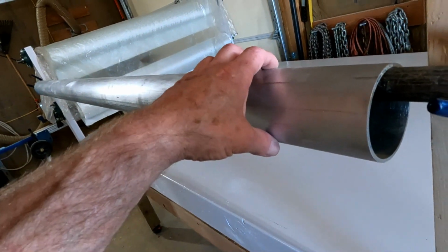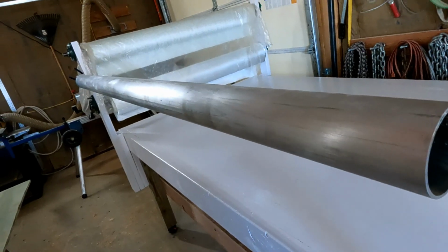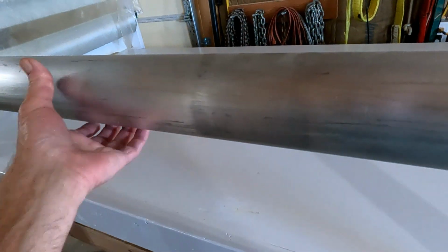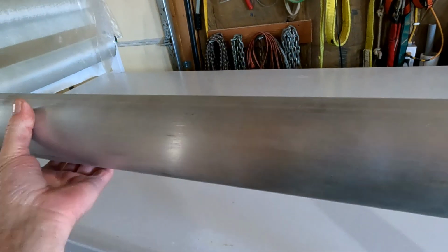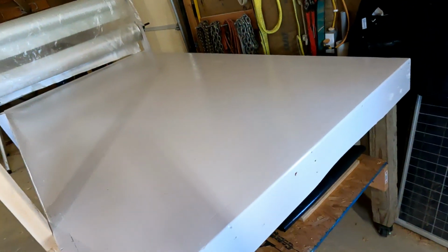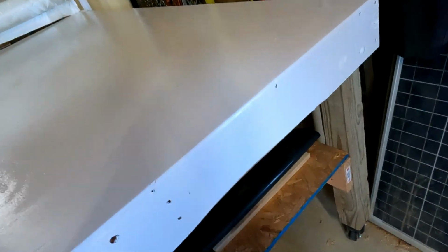But powder it first, put the aluminum foil on, and then tape the seam closed, and then we'll start laying up fiberglass on here and epoxy, and just rotating this as we go, and then putting the epoxy on, working it on there, and you put as many layers on there as you need to. And that's going to be for exhaust tubing.